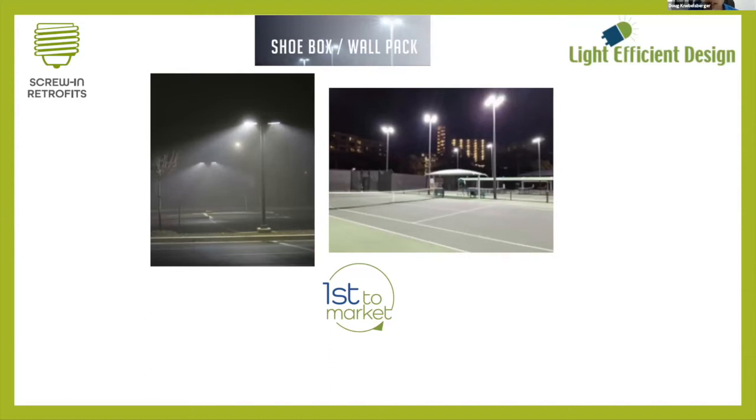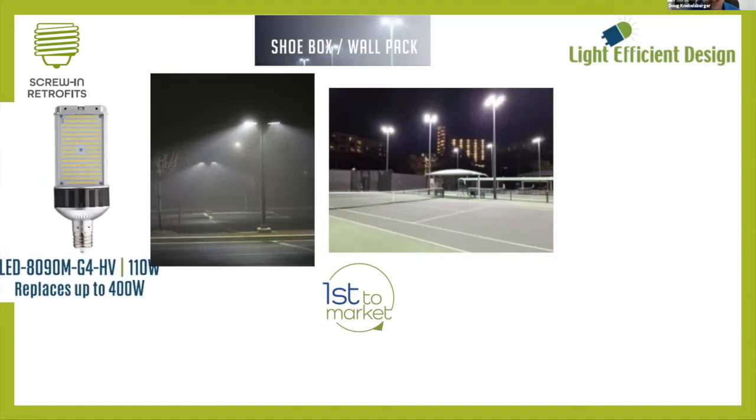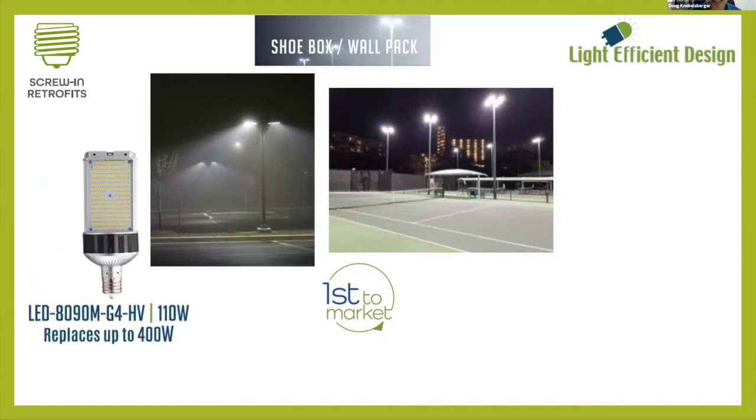So earlier this year, we introduced you guys to some smaller designs to help with that guaranteed fit. But what I'm going to introduce you to today, the first item, is our 8090 G4 HV. So this is our very popular 400 watt replacement lamp for shoebox or wall pack fixtures. The HV in the part number actually notes that it is 277 through 480 volt.